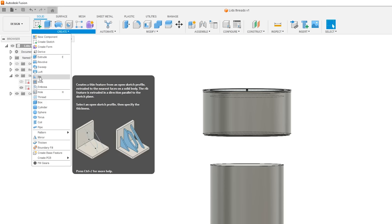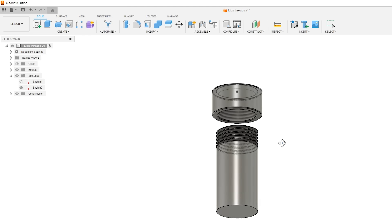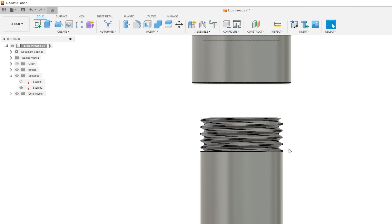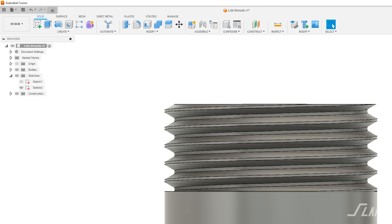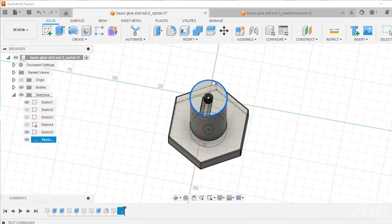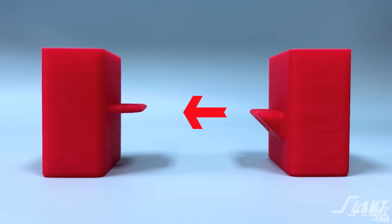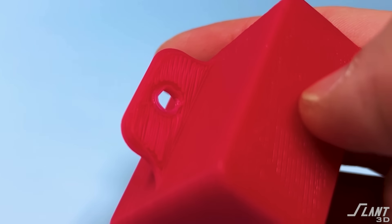Moving on to traditional mechanical attachments: threads. Threads are great. Make sure you're always using a triangular thread, and ideally one that's at a perfect 45 degrees, because then you reduce the overhang and you don't have to worry about threads slightly sagging and causing a really tight fit. You might not necessarily use a default type of thread — if you're designing the lid and the container you can design a custom thread using a coil or something to make sure it has a good profile that is useful and manufacturable. Because with 3D printing you have overhangs, and if it's less than 30 degrees from horizontal you may have some trouble with reliability. When you're making thousands of parts, you want to make sure the part is as robust within the process as it can possibly be.